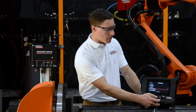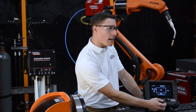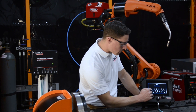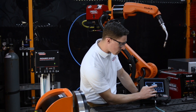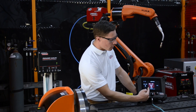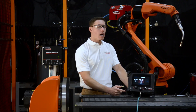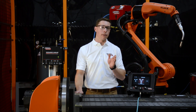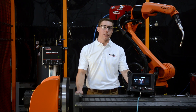And then we can update a job. Here we're going to save the job in an empty memory slot, and we give it a name — in this case, we'll call it aluminum. It saves the job there, so this is saved into job memory slot number seven. On our robot teach pendant, we will call an arc start and we will call job number seven, and then we call an arc end. It's as simple as that to run job mode.